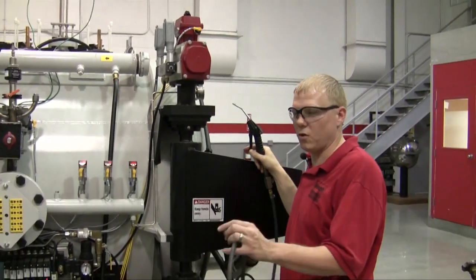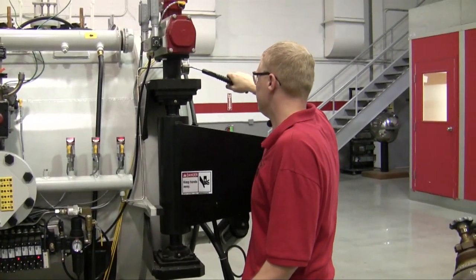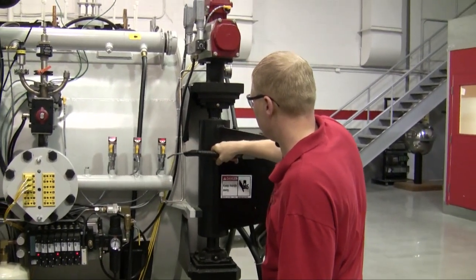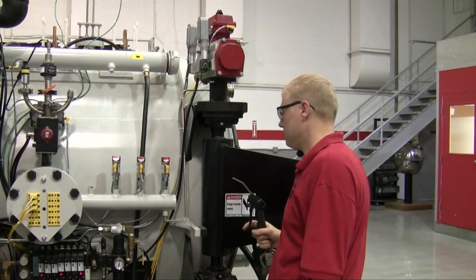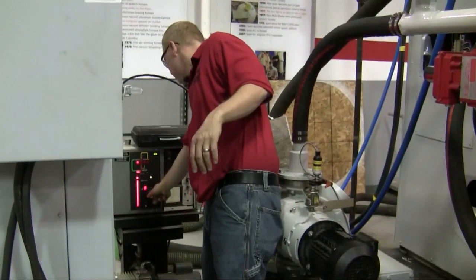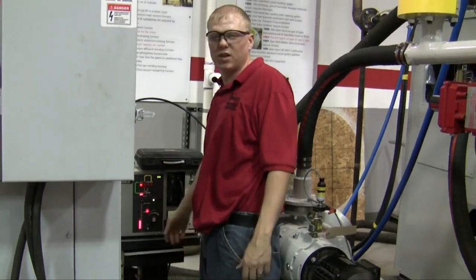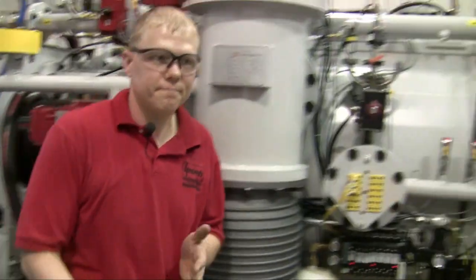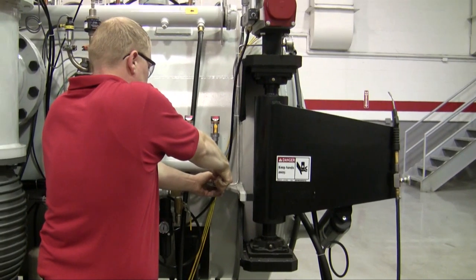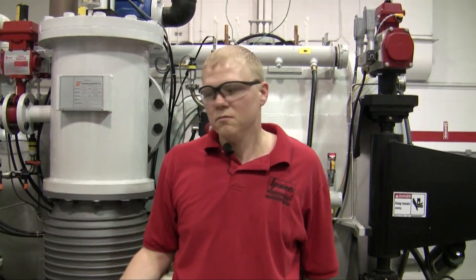There's a little drifting — it's going up a little bit but not drastically, so somewhere around here we have a leak. I think we just found it — see how it jumped up real quick. Go over to the leak detector and switch ranges; it's all the way up into the 6th range. Shut it down so you don't have to listen to that alarm. Go ahead and tighten it up. Bring the gas down — there's some gas in there so it will take a while to pump out, then you can hit it again.